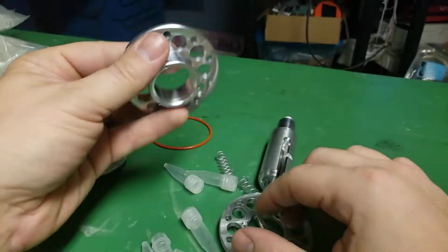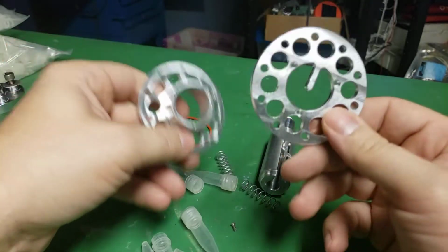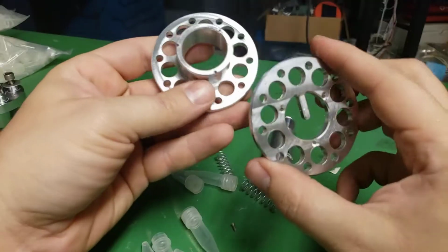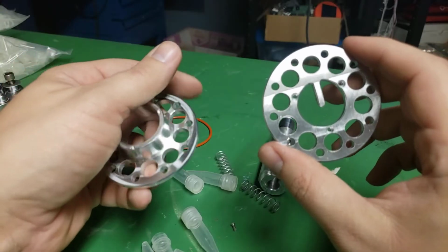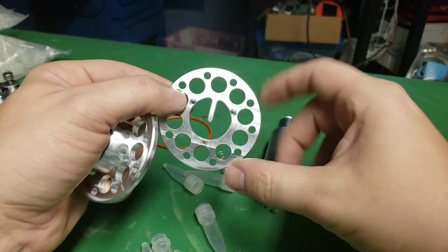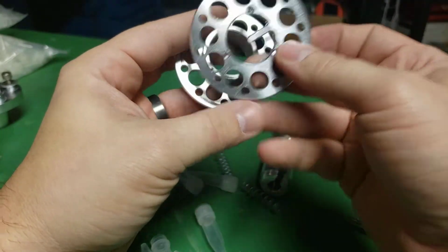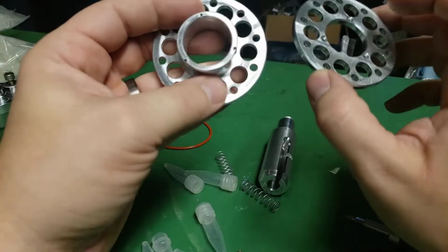So like I said, I machined this piece, and then I started machining this piece, and I realized, wait, these have to be connected together, and I hadn't figured out how I was going to do that. And so what I did is I added these 3 countersunk screws, which are number 1-64 screws, Phillips head countersunk. And then I had to add these 3 threaded holes manually. So I lined these up, and then I used a punch to mark them, and then I drilled and tapped them.